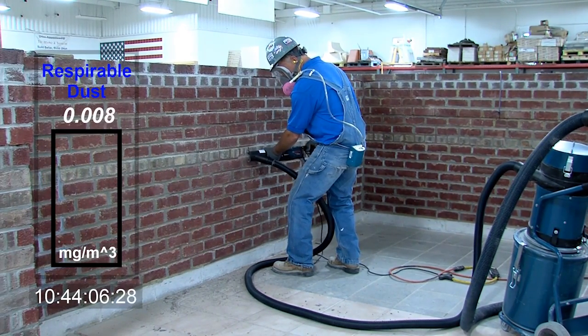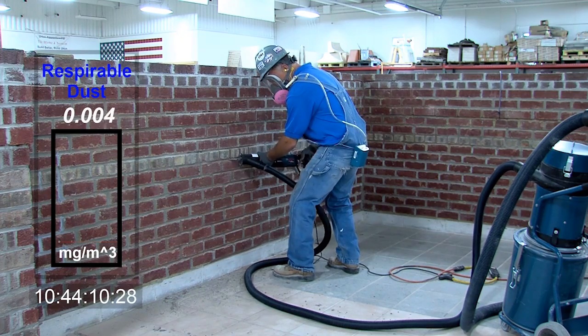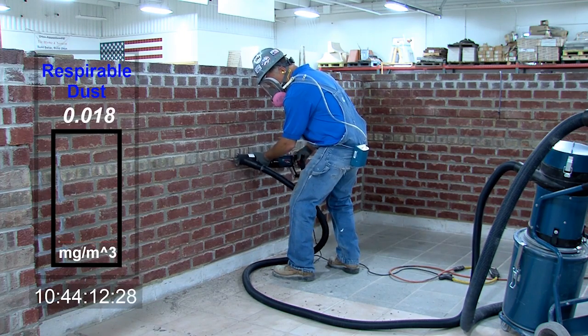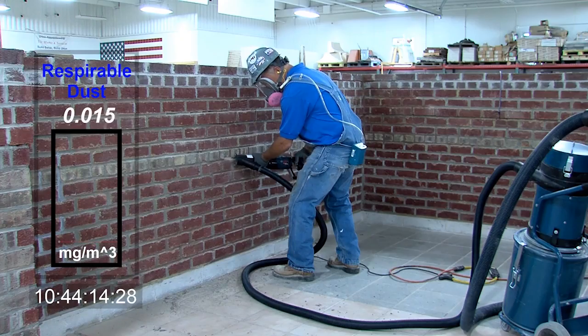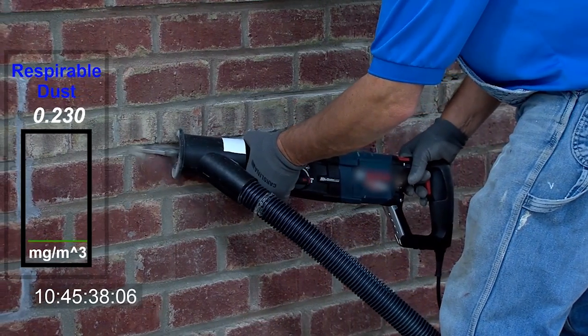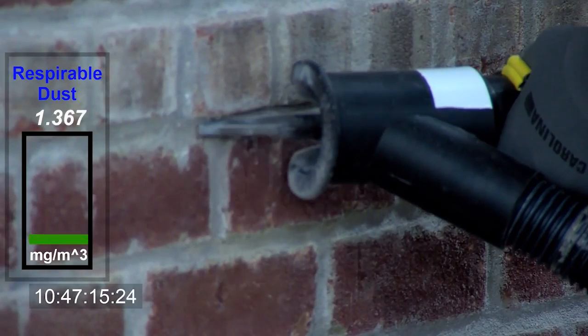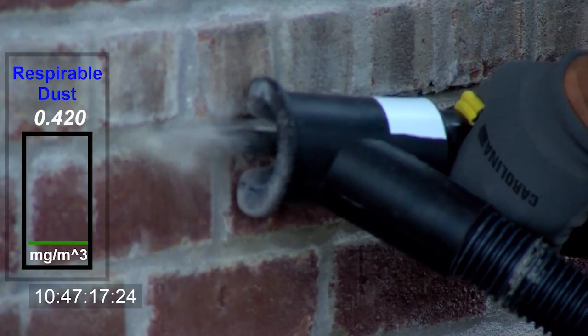Hold the tool with both hands. When using a rotary hammer and plugging chisel, the amount of pressure that should be applied is dependent upon the hardness of the mortar. Soft materials require less pressure while hard materials need more pressure. The plugging chisel is designed to crush mortar while preserving brick because the knife has no sharp edges.